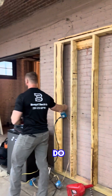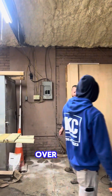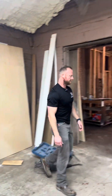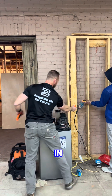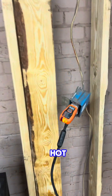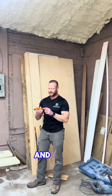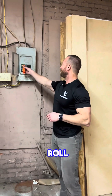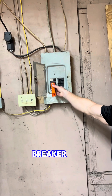This thing is hot right now. What do we do to turn this off? Go to the breaker panel. We'll have someone hold the tester on one end of the circuit, or we have a great plug-in tester like this, which I recommend for all of us as well. Now we can tell if the circuit's hot, the outlet's hot. You push this button and now I can go through the panel — and again, Klein Tools — and it'll turn red when it finds that circuit and tells you what breaker it's on.